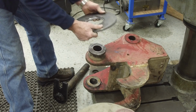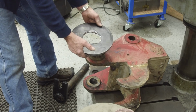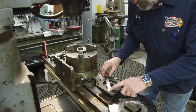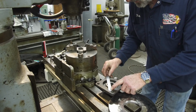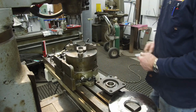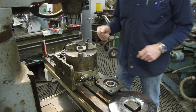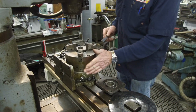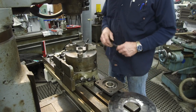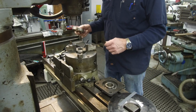All right, we're ready. We'll put them down like this on the table and we'll put that 4-hole pattern in the super spacer there. Awesome. Let's check out what hole center we're going to have, and it looks like 5 and 5/8. Half of that is 2.8125. All right. We checked our index. We have a masking plate for 8 in here, even though we need 4. So we got it set at 0. We're just going to do 0, 90, 180, 270 around the globe here.